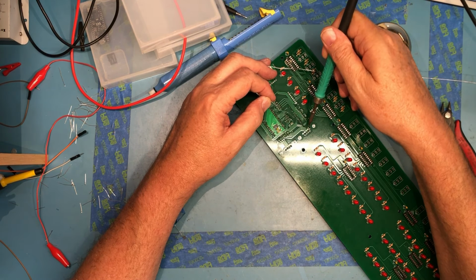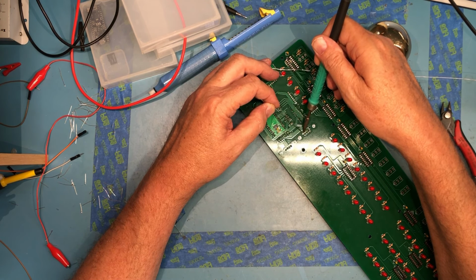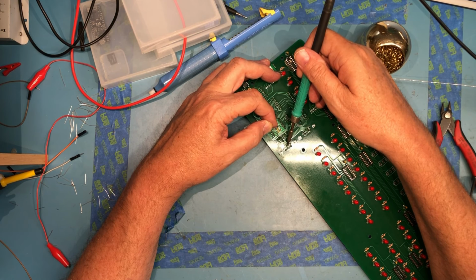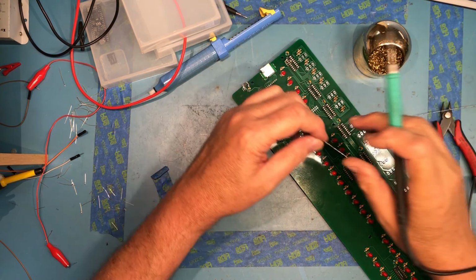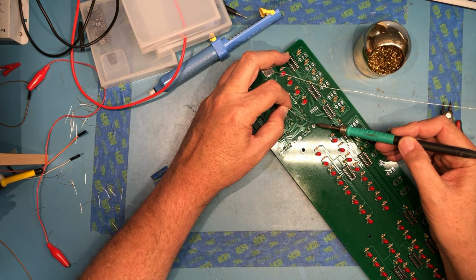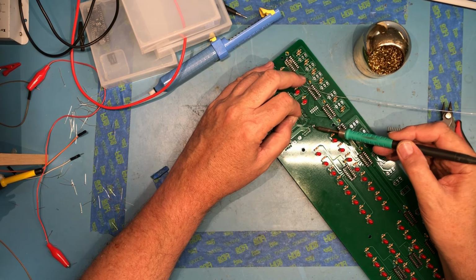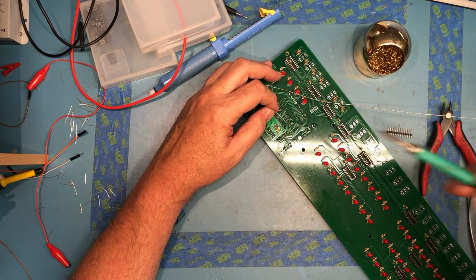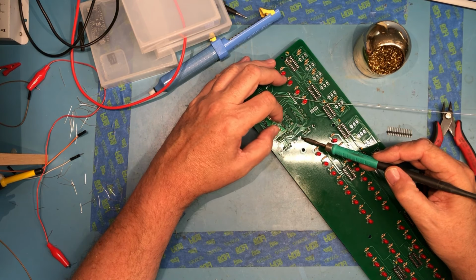On a great angle. I'm going to go ahead and put these clip through. Solder these up as well, just for mechanical strain relief. Now, just like the reset switch, I do recommend soldering in these mounting points. That just adds a bit of strain relief. If you are going to be using these connectors regularly, plugging things in and out, you don't want all the strain to be taken up by these three hot pins.